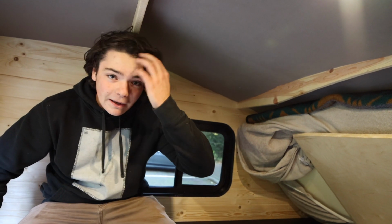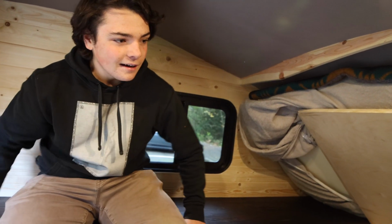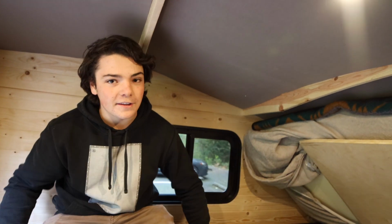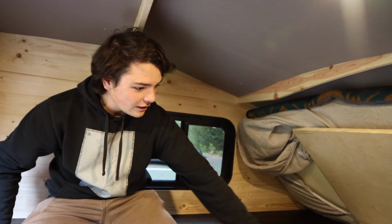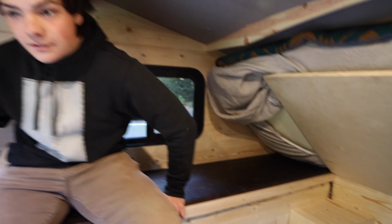And so yeah, this took me about a month to build. Started out with the tub here in the bottom. Got the framing up and the roof, and then it's insulated. You can actually see a little unfinished part down there, but it's 1.5 inch foam board insulation. And then yeah, just the siding, the pine siding, roof panels. Pretty basic framing and setup for that.